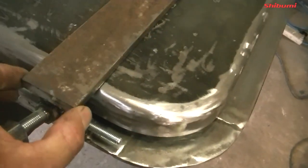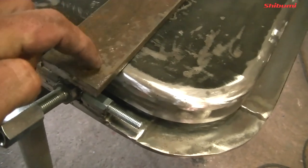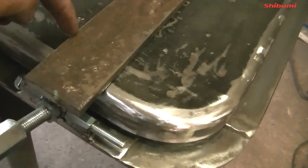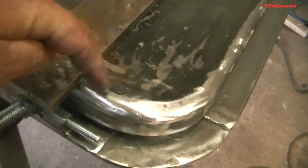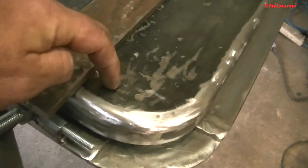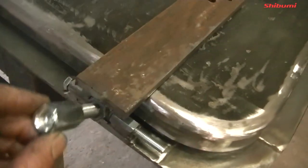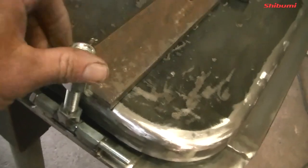And then I'm going to get, I have to get some more of this plate, something nice and chunky that I can put a nice curve on, put the slot into, and a curve, and then round that back there, and weld this all round. And remember, I do have strength here because I have two channels right underneath me there, of the 225 mils underneath me, so that'll be good and strong. So that'll go there, and this will meet it, and then this will get wound down.